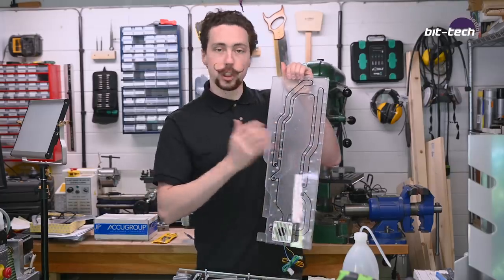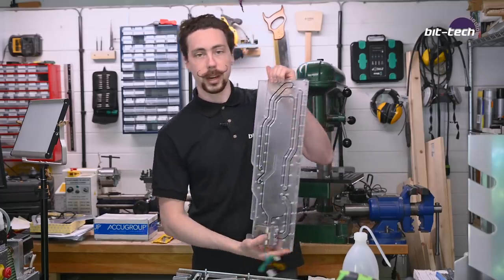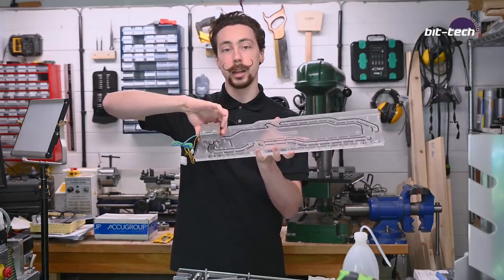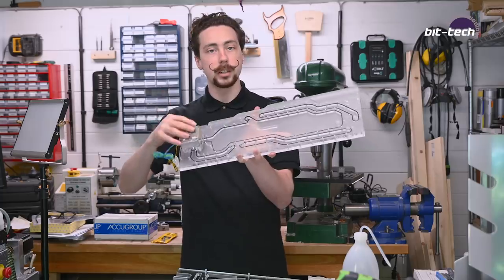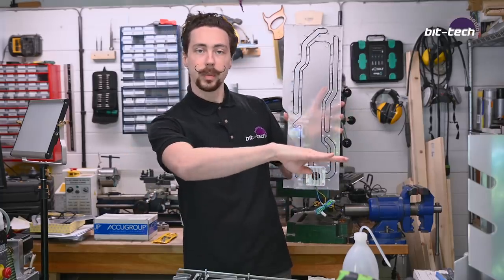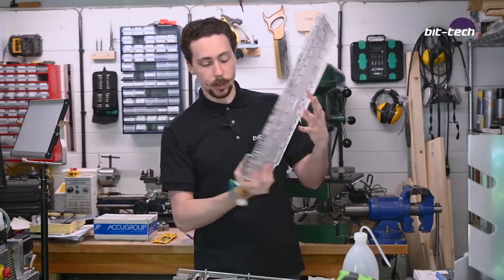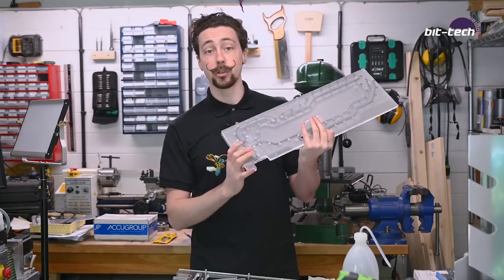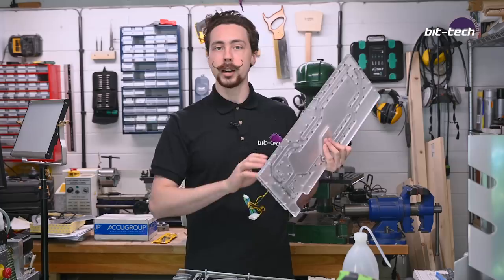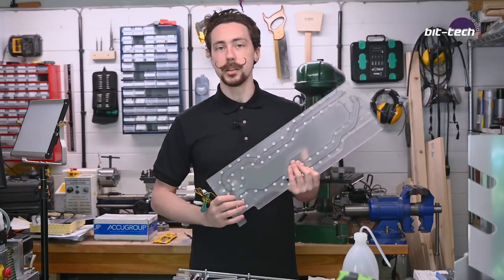We're going to have the ports for the GPUs, and the ports for the radiators are on the back, and then I've also made a pump mount. So this is made out of the 20mm acrylic, and then that literally just fits straight into the DDC, and that's going to be sitting below the cover. So it'll be nice and out of the way, really simple, and I'm hoping that's going to give some really strong flow and some proper pressure, because DDCs have really high pressure. It should be able to handle this loop really easily, not a problem, and it'll keep it nice and simple.